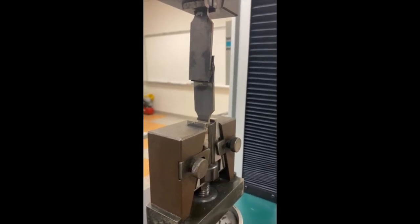The lap shear test determined which adhesive was the strongest by applying the adhesive to the rubber and 2 steel plates and pulling until failure. A high failure load as well as failure in the rubber was a good indication of adhesive strength.